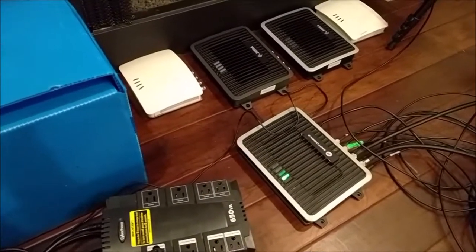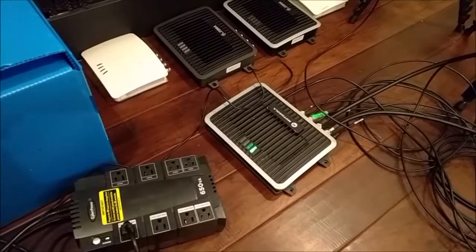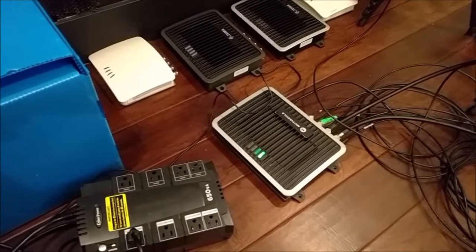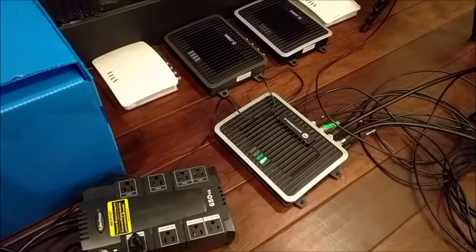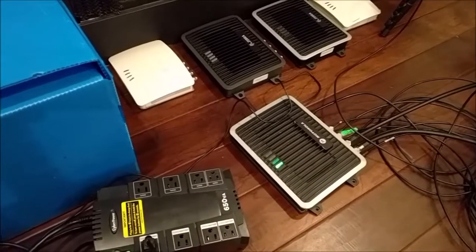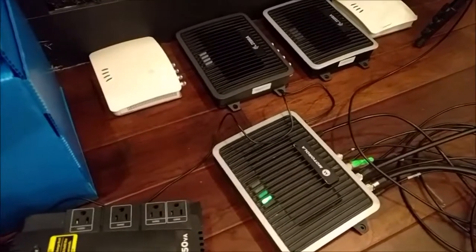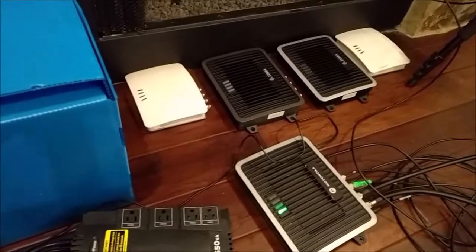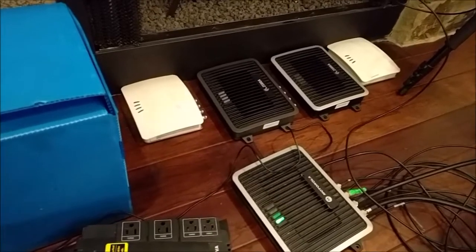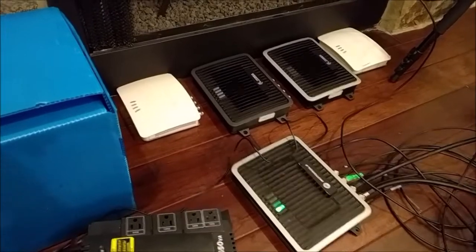A user sent me a very interesting video where he had an FX9500 hooked up to some race result mats, and he had an RFID meter over that mat — it was pegged out at 100%. Then he walked over to a second line of mats, same model, but hooked up to an FX9600. With that reader it was jumping back and forth between 50% up to 100%, instead of a consistent 100% coming out of the antenna. So I've decided to do the same test.